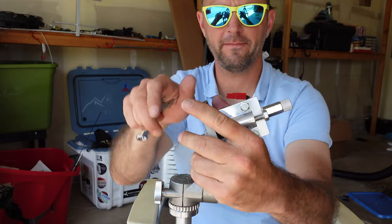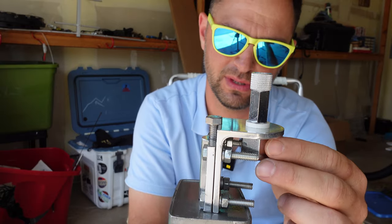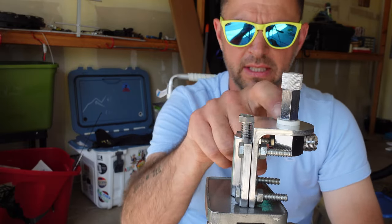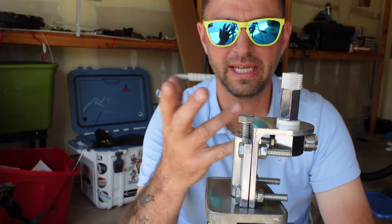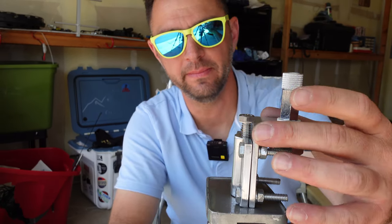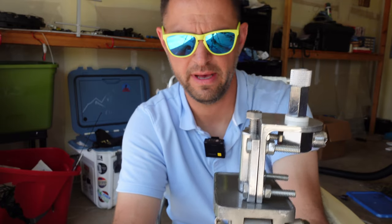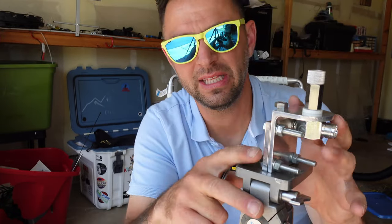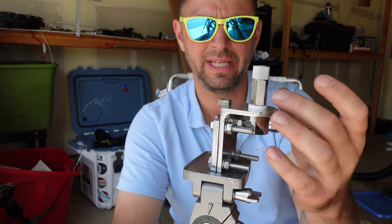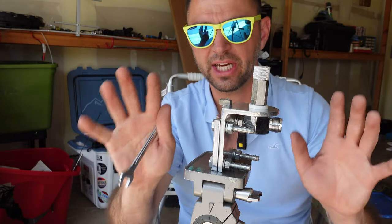Now let me explain why I put the insulator on the top as opposed to toward the bottom. If I put it on the bottom, the whole L-bracket would be touching the metal, which goes through the tripod - all metal - and the whole structure would become part of the antenna. I didn't like that, so I put the insulator on the top, making sure the actual antenna portion shouldn't be touching the L-bracket internally, so there should be no continuity.